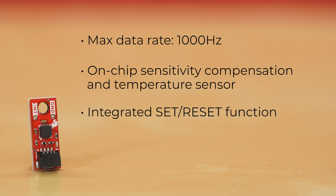An integrated set/reset function provides for the elimination of error due to null field output change with temperature, and can be performed for each measurement, periodically, or when the temperature changes by a predetermined amount as the specific application requires. In addition, the set/reset function clears the sensor of any residual magnetic polarization resulting from exposure to strong external magnets.